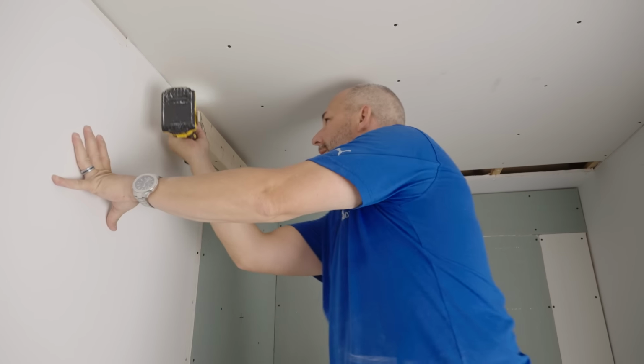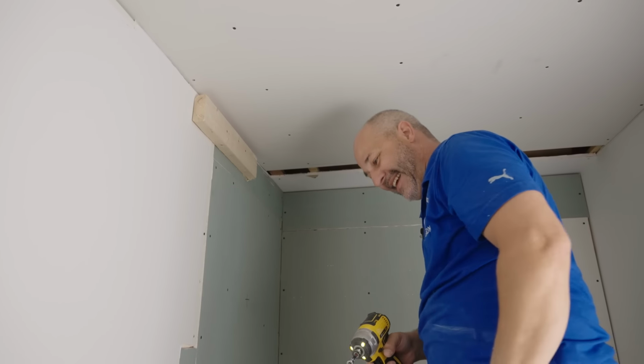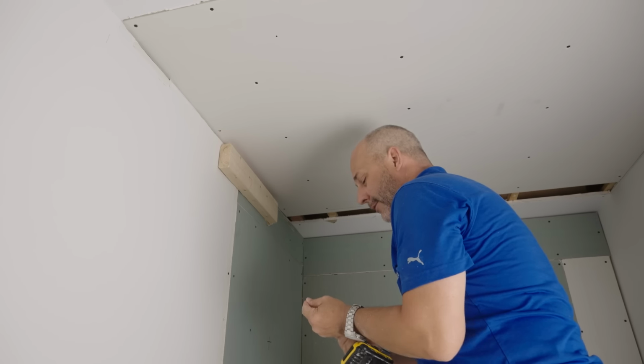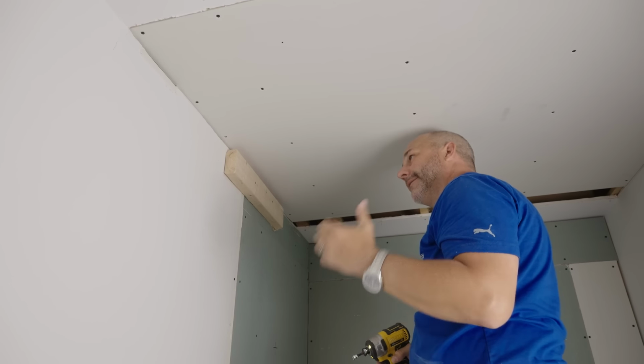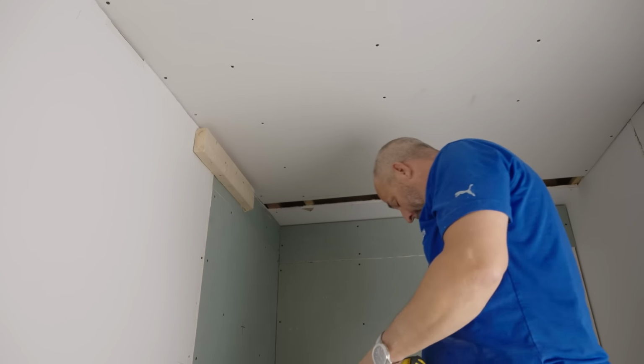Look at that, I've got recycled screws. They don't go in as nice because new screws are covered in graphite powder. That way they go into the wood really easily. It's like a lubricant. If you save your old screws, you're going to find that they have no lubricant, so it's a lot harder to put a coarse thread screw into a piece of wood. All right, anyway.